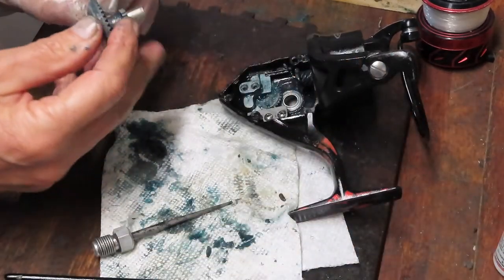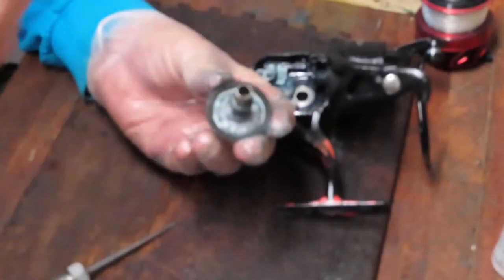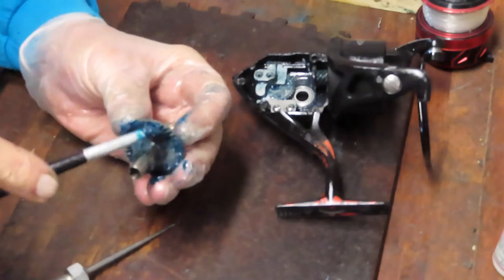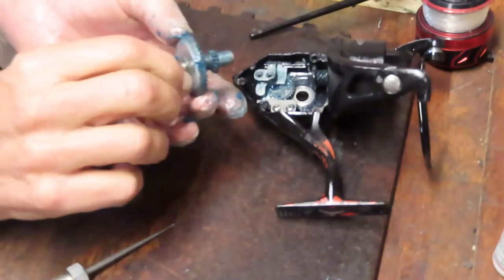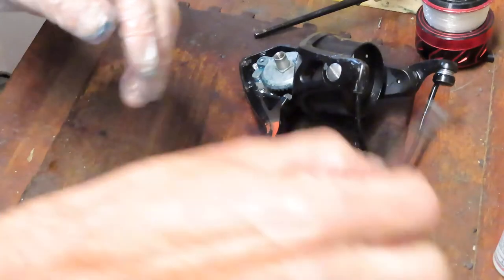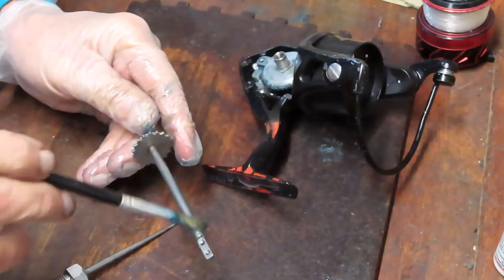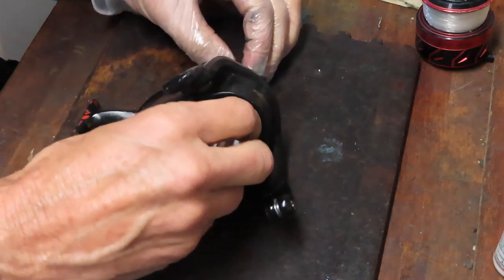Go ahead and reload the crosswind gear, then put the main gear in. Make sure to put a good amount of grease onto the teeth of the main gear, same thing with the back end — it's going to drive the crosswind gear. Go ahead and put that on, then grab that axle shaft. The axle shaft seems smooth, but my guess is that this is the culprit because they take a beating on the boat — if they hit a rail or there's a big fish at the top of the stroke, it could cause the problem.